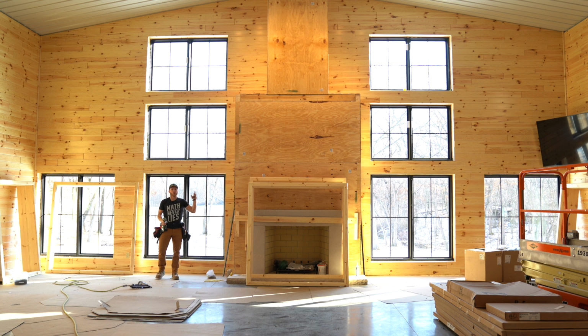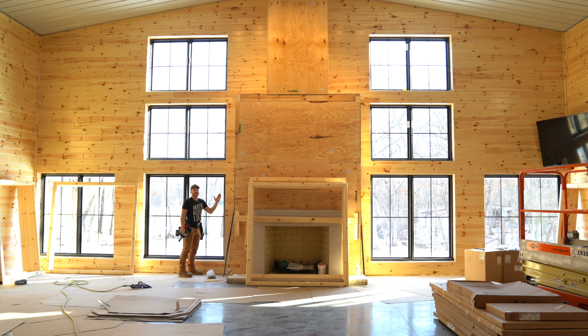So what I'm doing is we've got screws in the jamb around the perimeter, and I'll show you a little closer, those screws are going to secure the side of our box so that we can make sure that it stays perfect where we want it versus nailing flat to the wall. And these screws we can push in and out to make sure that they're exactly where the edge of the window is, so when the box goes in and we nail the jamb extensions to the frame of the window box, it doesn't suck in and get wavy. It'll be held nice and tight. So I'm just adjusting those in and out to exactly where we want them.